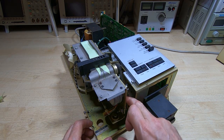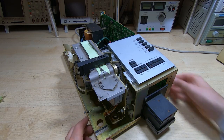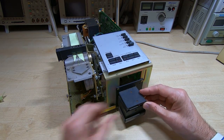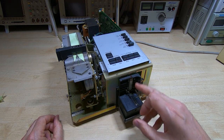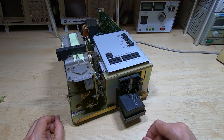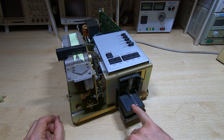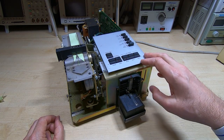The tensioner seems fine - this is a tensioner for the drive belt. We've got a control panel which is just a series of switches. At the front we've got the tape reader, which spins relatively freely. We have a light source and sensors - the light source shines through the holes in the tape, the tape advances, and it reads the next position. We've also got adjustments here - little pins move so you can change it from eight-hole wide tape (one inch) to five-hole wide tape, and this unit will handle both.